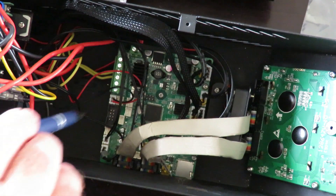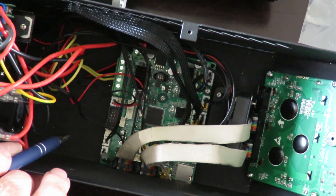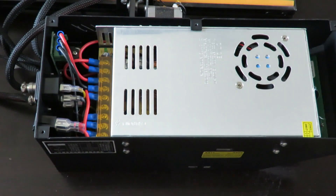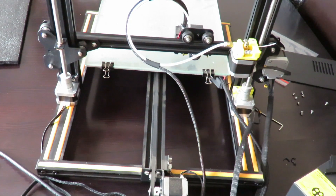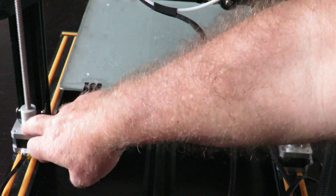Nearly forgot - that's the control fan. I've got two control fans in there and I've got to connect one of them. We'll close it up now and hopefully everything will work. Don't forget to use zip ties and tie everything back. I've now got the power supply screwed in position - all I need now is to place the base on with five screws and we're almost ready to fire it up. I've just turned it on and we're about to move the Z-axis. The coupler was a little bit too tight on the stepper motor at the bottom, so I've just lifted it up a fraction and it's working perfectly now.